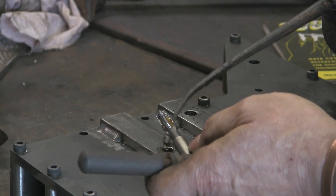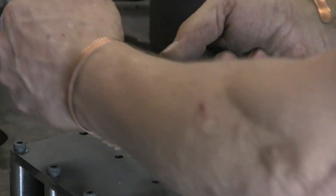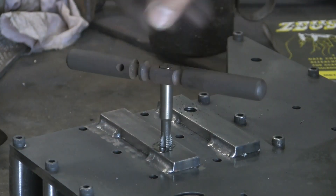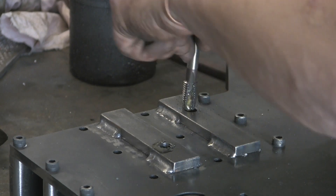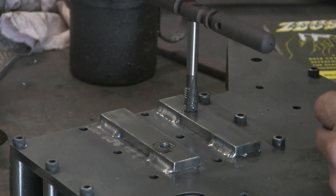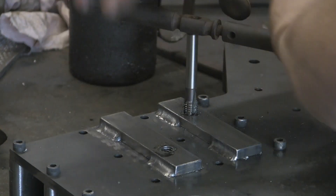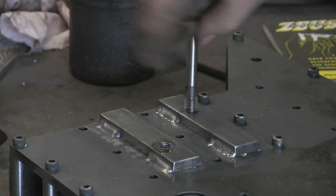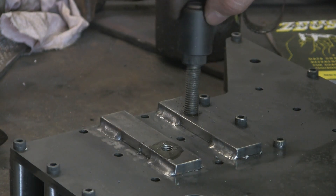I'm not sure if it's going a bit tough because it's slightly hardened where I've welded it, but you would have thought that would have happened the first time on the other side. This 10mm tap isn't the sharpest, and we've done it. I'll do the same with the 12mm. I really should have got the bigger tap wrench out again - I use that all the time for a 3/8 Whitworth for my shoeing, for stud holes. Well, there you go - see if it'll fit.